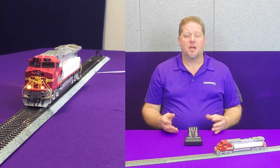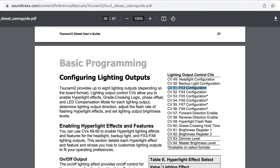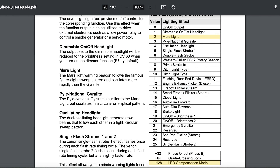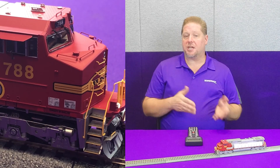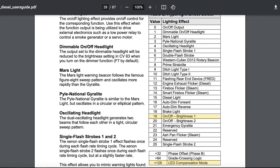What we're going to do is actually just change the lighting effect to something simple so that we can see which lighting effect changes its light pattern to match. Today, we're going to use the Mars light. When I go to the user's guide, you can see on the chart that FX3's lighting effect is controlled by CV51. To do this, I'm going to program CV51 to a value of 130. That selects our Mars light in addition to LED compensation. When I hit the enter button, we're going to see which lighting effect changes. On this particular model, you can see that the truck light changed. So since our truck lights have now started flashing, we can go ahead and set those back. We're going to set CV51 to a value of 147, which is our on-off brilliance 1 with the dim register.